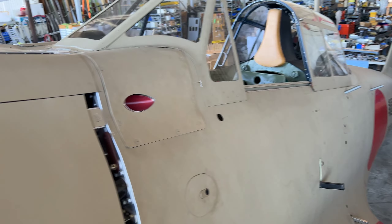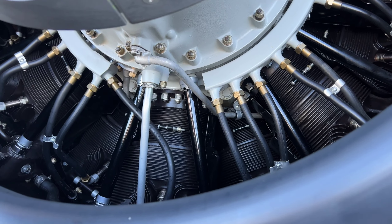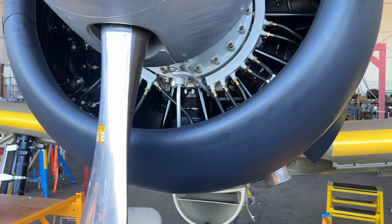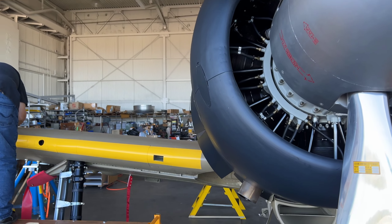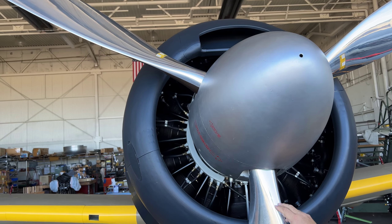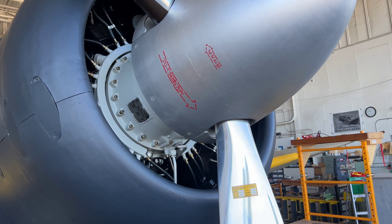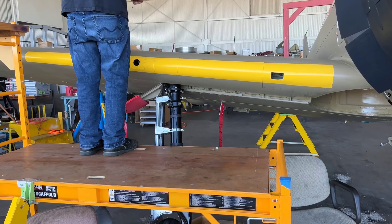This 1830 is painted up to look like a Japanese engine, with the gray case and everything. That was specially painted by our engine manufacturer, Precision Engine, here in Paine Field. Those are brand new cylinders — from Pratt & Whitney, they bought a license to make them brand new — so hopefully they'll hold their color for a while. It is a radial engine, so it will leak and get old. This is a Super Constellation spinner that's been modified to look like the Japanese spinner — off one of the Connies. It's amazing all the different workarounds you have to do to replicate and restore something as close as you can to the real thing.